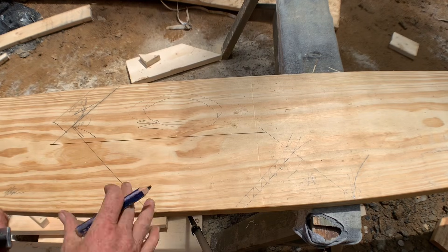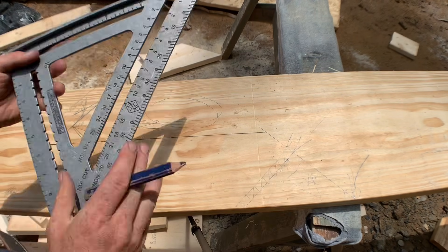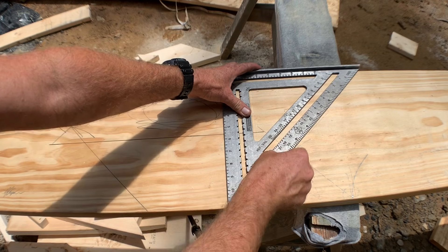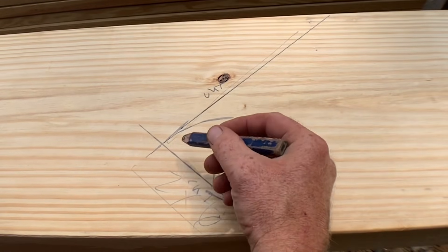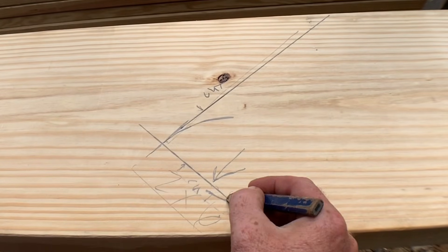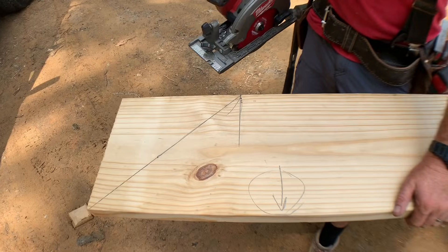On this particular rafter I don't need any overhang — there's going to be a porch roof that butts in way up here. So I'm going to clip this rafter tail off vertically right at the outside edge of the house. Since this is a 12/12 pitch, I can use the speed square as a 45-degree guide — the same as 12/12 — and run this line up to get a vertical line flush with the outside of the wall plate. A quick note: to get more accurate cuts, cut on the correct side of the line. If you cut on the wrong side, you'll take an extra eighth inch out of your measurement because of the saw blade kerf.